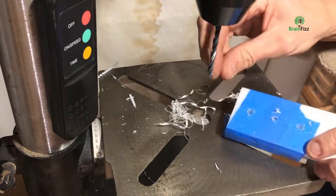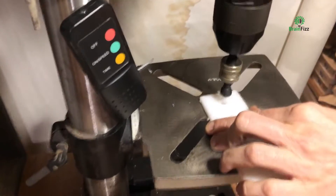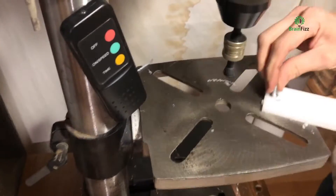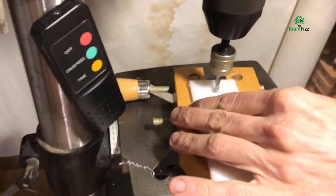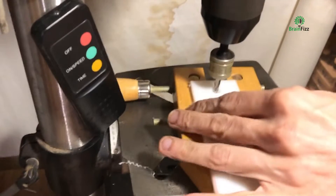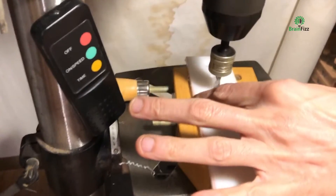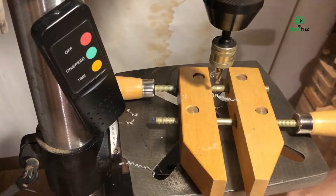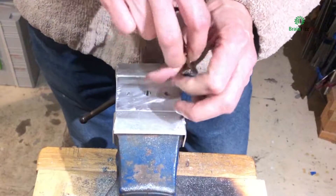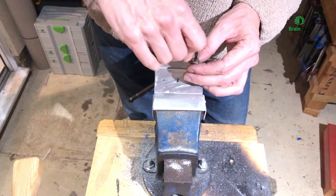By taping them all together and drilling the pilot hole in both, it just ensured that everything would line up when it all got bolted together. I'll reuse that bit of plastic later. With the holes drilled through the plastic, I spread the two apart and then just countersunk them so the screws sit a bit below. The final job is to just open up the old pilot holes into clearance holes so that the threads of the screws don't engage, and therefore just rack the two parts together with a nice hole allowing it to go through.